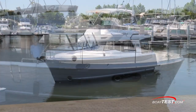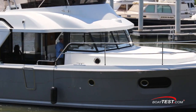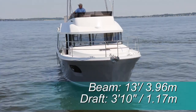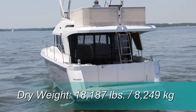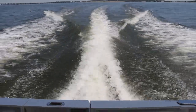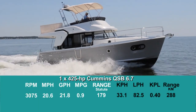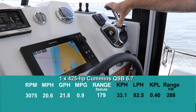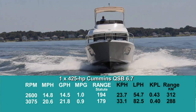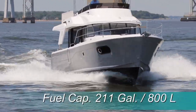As I was pulling out, it immediately became apparent that this boat was easily handled, so I did some messing around to further test her maneuverability, and it just refused to be a challenge at all. Soon we were lined up and headed out the fairway for open water. The Swift 35 has a length overall of 37 feet, a beam of 13 feet, and a draft of 3 feet 10 inches. With an empty weight of 18,187 pounds, 85% fuel and four people on board, we had an estimated test weight of 20,057 pounds. With the 425-horsepower QSB 6.7 turning a 24-inch by 24-pitch five-bladed prop and spooled up to 3,075 RPM, we reached our top speed of 20.6 mph. Best Economic Cruise came in at 2,600 RPM and 14.8 mph, where the 14.5 gallon-per-hour fuel burn translated into one mile per gallon and a range of 194 statute miles, while still holding back a 10% reserve of the boat's 211-gallon total fuel capacity.